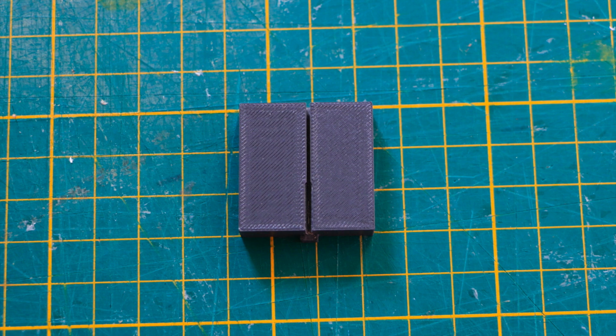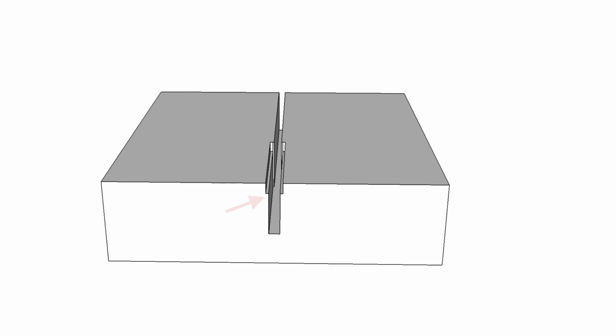The mold I designed has two connected slots, a 0.75mm wide guide slot which opens up into a 1mm wide mold slot that is 10mm long. The top portion of the mold slot is made wider at a 1.5mm gap, which creates a 0.25mm flat edge on either side of the slot.